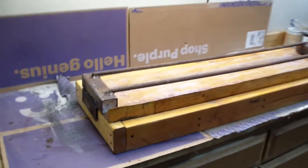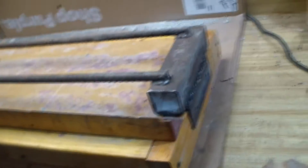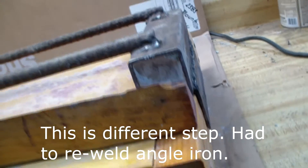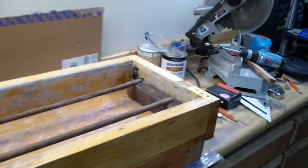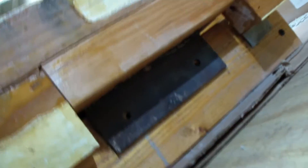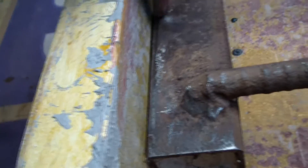I have the rebar frame sitting on the lower half of the mold — just take a nice look at it. I want you to notice that when I welded this tab, it comes out about ⅛ inch. So the step is going to be flush with this 2-inch by 2-inch piece with this tab coming out an extra ⅛ inch. Here's the mold with the top half on. We can see there's a little hole in the bottom where the shank can stick out. The frame is flush with the back of the 2x2.